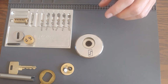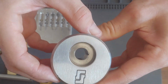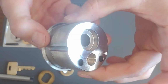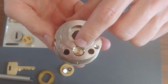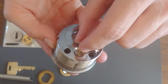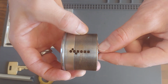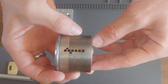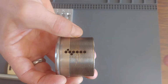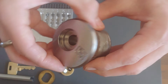That's more like it. So I will give you a close-up of all these parts. You have the lock body, got the sidebar groove here, very beefy piece. You can also get it via this rod here. It's got a flat screwdriver part. You just unscrew it and it pulls out, and you can see it down these holes. That'll just make it able to get it via the top. It's not the easiest to put back together. You have to push down on the spring and make sure the rod doesn't squeeze those springs. So I just rather got it the standard way.